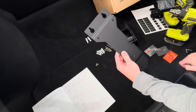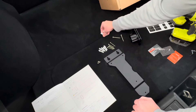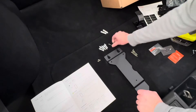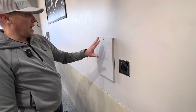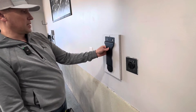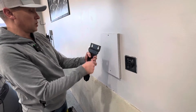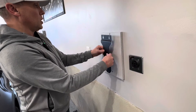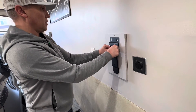I'm getting ready to mount the bracket to my wall. There is some included hardware: two longer bolts for the top and anchors if you're going into drywall, four bolts for the plug holder, and an extra one for the bottom of the bracket. I cut a piece of wood — about 14 inches tall — and the bracket fits right on here. The reason I did this is there's a stud here; I want both screws into a stud to make it a sturdier application.